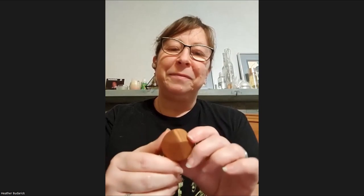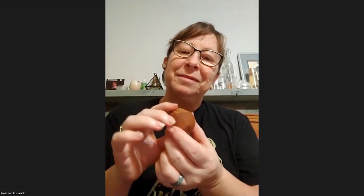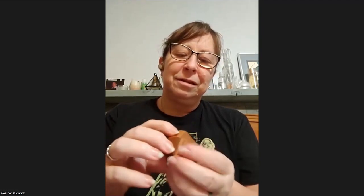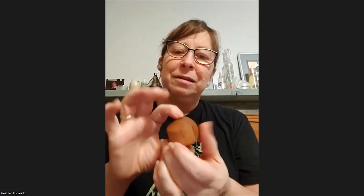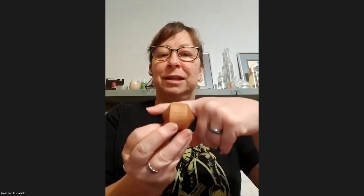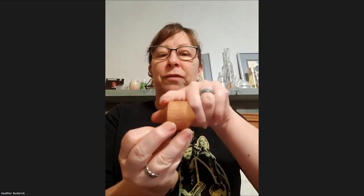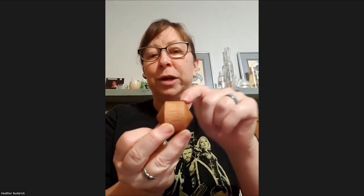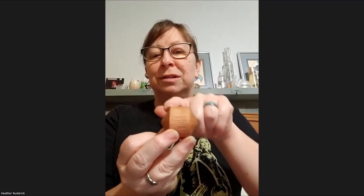That is some really good turning, and it's excellent turning practice because the dimensions have to be perfect and precise. You're turning it at 90 degrees, so it looks round, but it has to be the same profile. It just looks like this on the lathe. All you see is half of it, right? And all of these sides have to be exactly the same length. There's a 120-degree angle here on the corners. Every corner will have 120-degree angles on it.